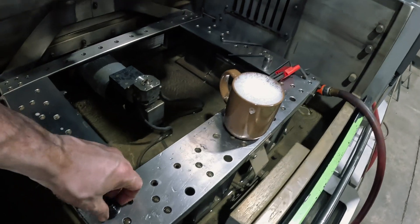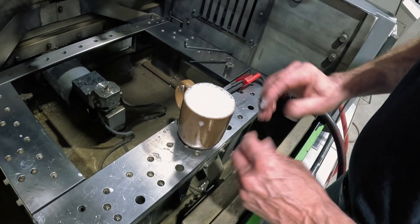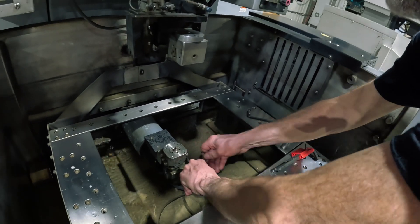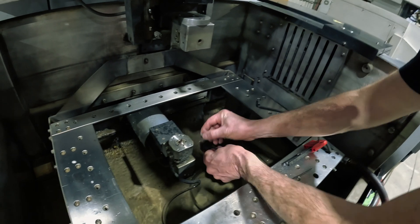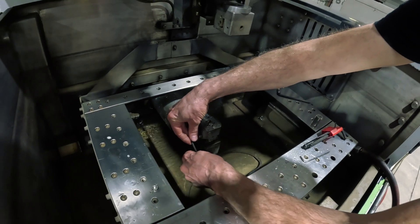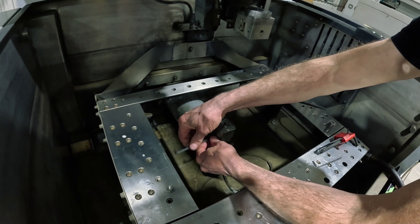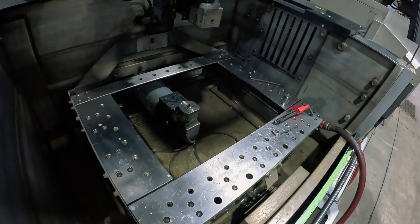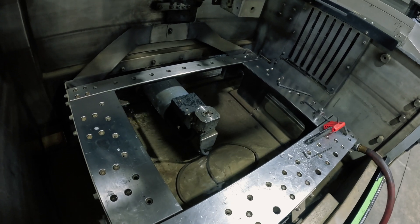It's important to get this nozzle out of that bottom piece. Now we're going to start taking the bottom part off and he's going to take some of the cables off here. Again, keep track of all your screws. The parts that we soaked in the cup, we're just going to soak them until we're ready to put them back together again. We'll wash them down and then reassemble them afterwards. Also put all the screws in that you're taking apart, especially off the cables, so make sure they get nice and clean for good contact.